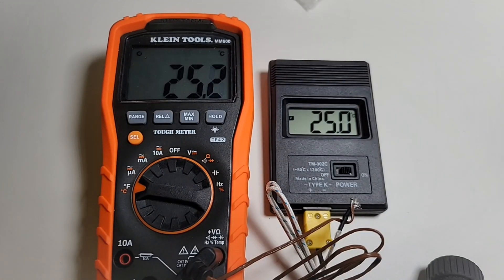I've taken the thermocouple from the Klein tools and wrapped it around the 902C, and look at that — they're basically in the same space. Almost verbatim: 24.3 for the Klein, 24.0 for the 902C. Rock solid. Worth noting: we are only in Celsius mode on the 902C — there is no Fahrenheit. But it seems to give quite a stable reading: 22.9, 22.8.